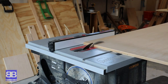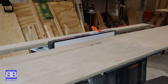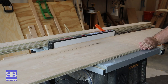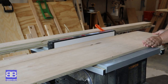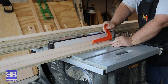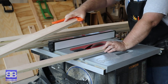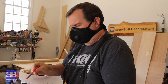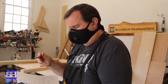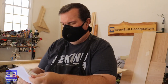I've got just a few more rip cuts to make. I need to rip the cross supports to the top. I think just laminating the outside two runners will give plenty of strength to the bench, so for the cross pieces, I'll keep them at three-quarters inches thick and four inches wide. I'm kind of playing it by ear on how many cross pieces I'll need, so I'm probably cutting a couple more than I'll end up using. It's always a great idea to stop once in a while and review the plans on what you have already done, where you are now, and what is left to be done to make sure that you're keeping on track.